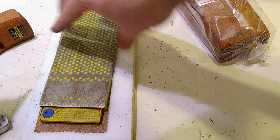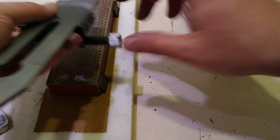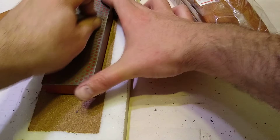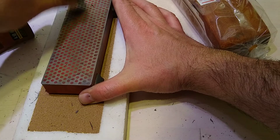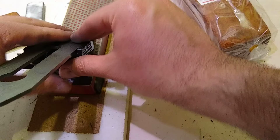There's another grade of stone here after ultrafine. And it's most important to do this eraser thing with the cast iron bodies, because when you scrub it off, a large portion of the dust is basically graphite, which is a lubricant. So maybe we'll do this 70 times because of the much smaller surface we're on.